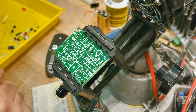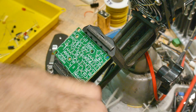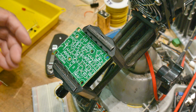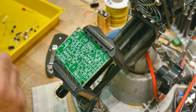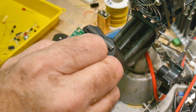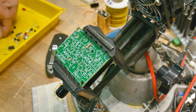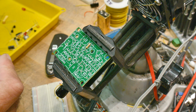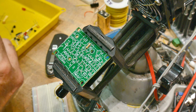I think I'll turn on my meter here so I can read ohmage, so I don't have to read the color codes. Although these look okay. These are pretty nice color codes, but I'm just lazy today, so I'm just going to measure them. All right, this one is 46 K ohms, otherwise known as 47 K ohm, which is R13. Put him there. And this one is a 46 K ohm resistor, otherwise known as 47 K. We'll put him on R14.